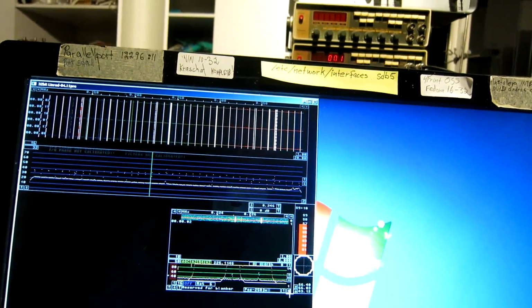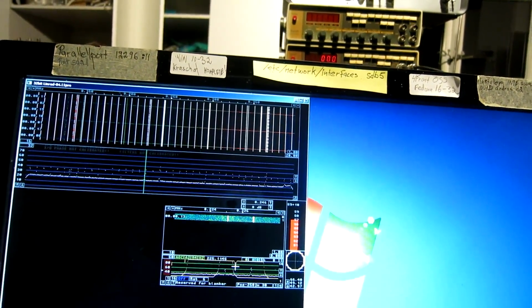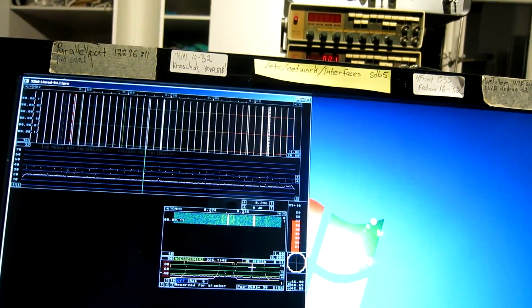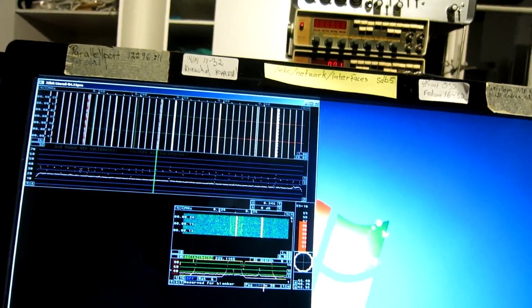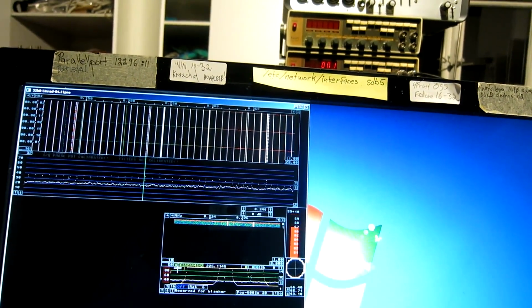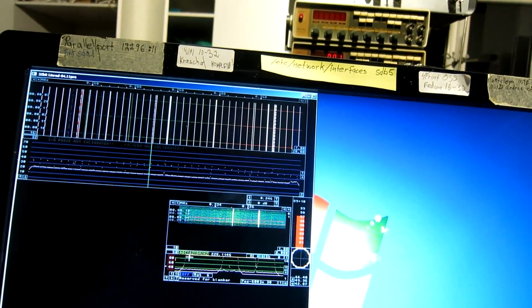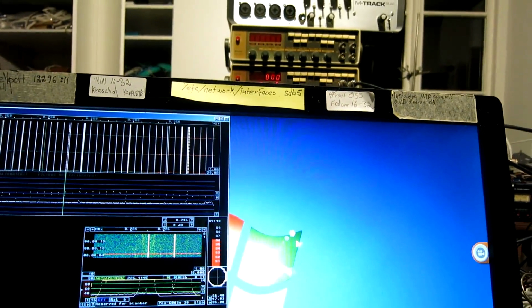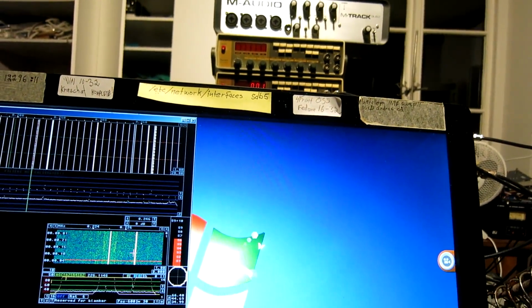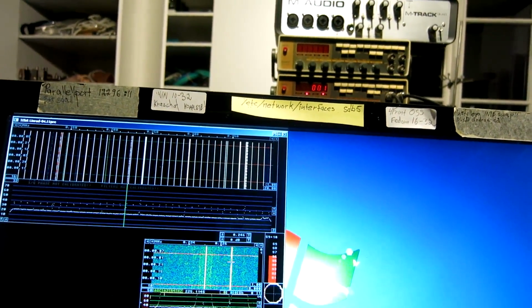And I place it at, let's say, minus 250. And then I make the width, let's say, 30. And you can see here is the notch. And I made it 250. It should be about maybe 600 to come on the right position. So I change that, minus 600. And it's close. I can change the filter bandwidth, which will move the notch in proportion. And now you can hear again the signal, because the notch removes this carrier from the output. We can still see it in the waterfall, but it's not routed to the loudspeaker anymore.